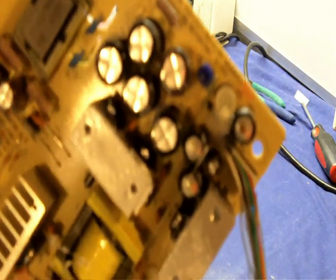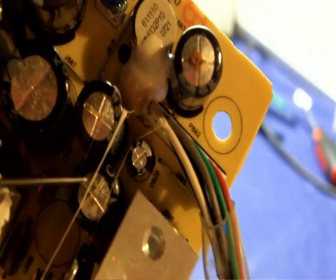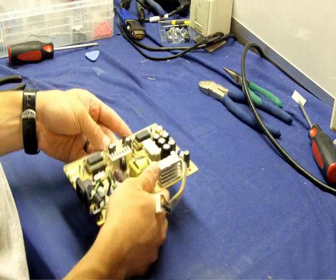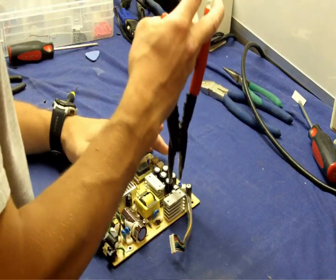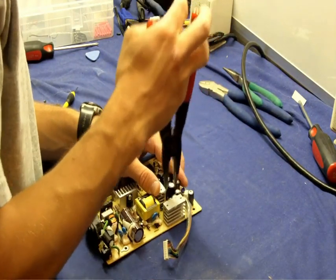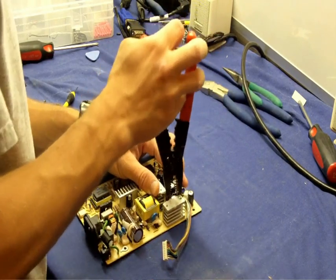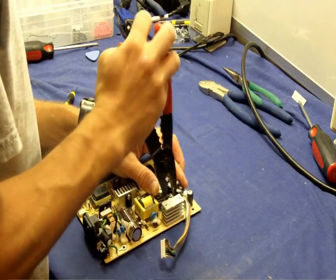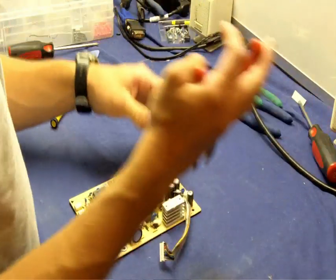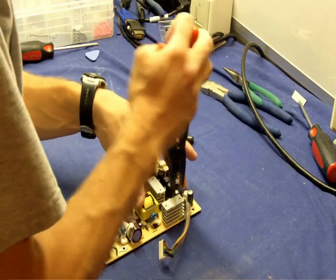I want to get the board closer and show you what we're looking at. The numbers on the circuit board are C824 and C825. If you take a look at these capacitors on top you'll notice they are busted — they have exploded on top and are leaking a light brown gel-type substance. You can use your solder gun to remove these, heat them up and pull them out. There's enough room to just break them off. There is a small resistor on the edge of the board to watch out for, but everything else is fastened down or out of the way enough to work around.